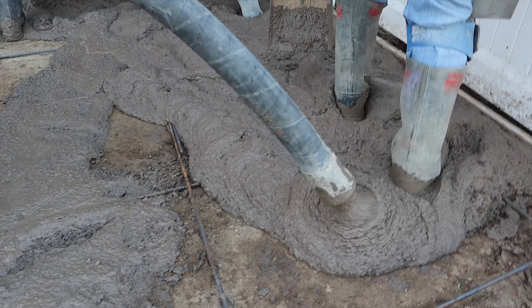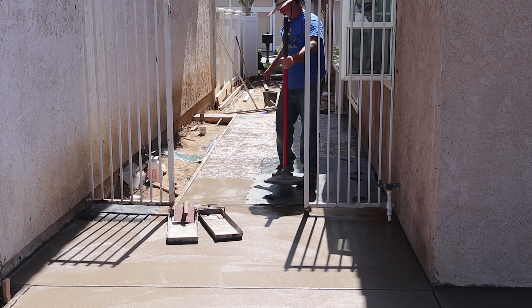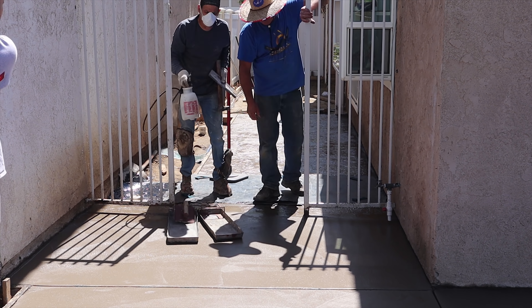This concrete actually dried backwards — from the end to the beginning. We try not to spray the release out in front of us too much, because by the time you get there it may evaporate on you and then you have to double-spray it.